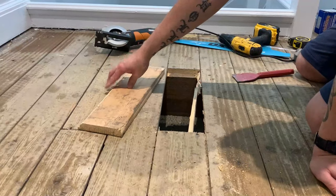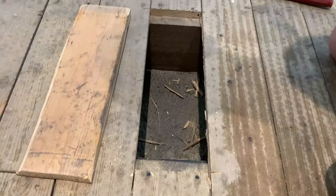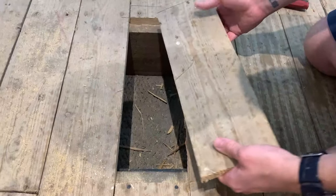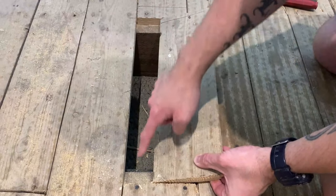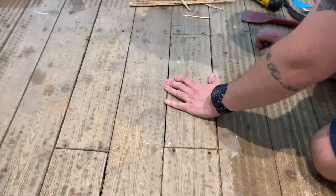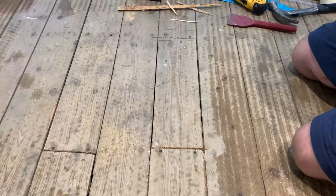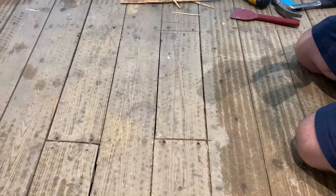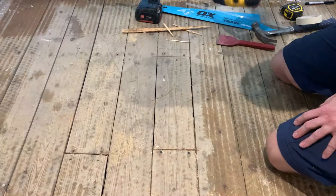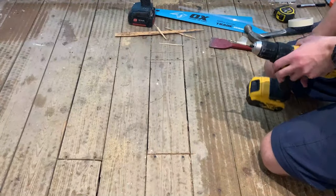Using the chisel method you do break away a bit of the floorboard. I've cut them fairly cleanly — well onto half of the joist, so when it goes back down it'll easily be supported by the joist each end. When I put floorboards back down I don't like to nail them in case they've got to come up again — it's much easier when they've got screws. I use 45mm or two-inch screws, and because I'll be screwing close to the end of the board I always pre-drill with a pilot bit first.